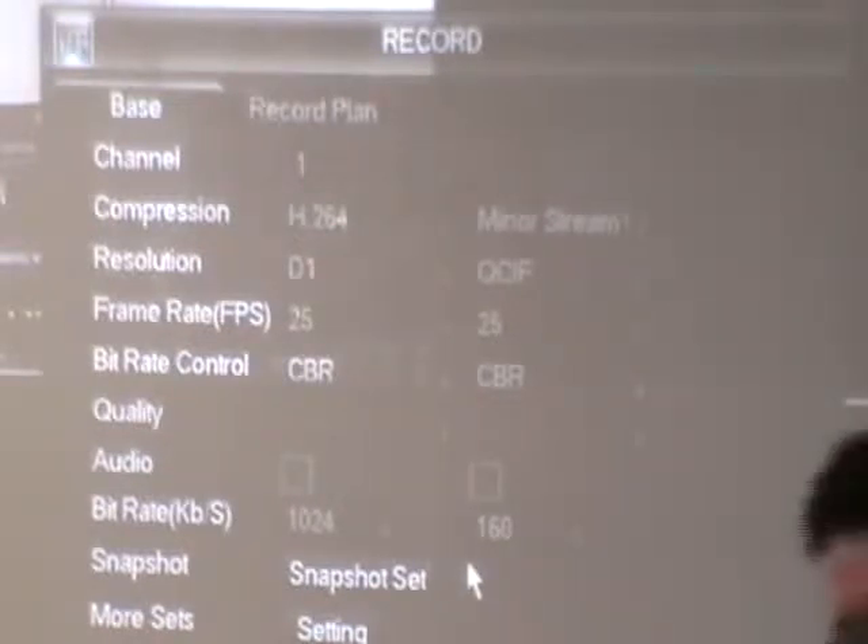I did a calculation this morning on the 16-channel DVR: 16 channels at full D1 recording means you barely get a day out of a 2TB hard drive — there's so much data that a 2TB drive fills in about a day. So you need to conserve either recording time by setting motion detection so it only activates when needed, or drop some less-important channels from D1 quality. If full quality is critical for every channel all the time, you're probably looking at the next level: IP-based DVRs with network-attached storage and multiple hard drives.